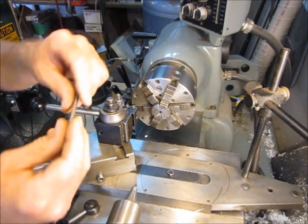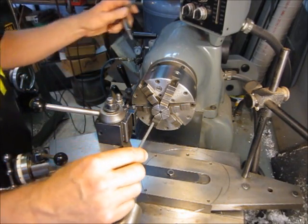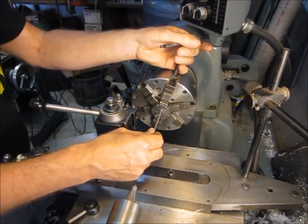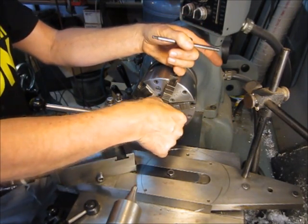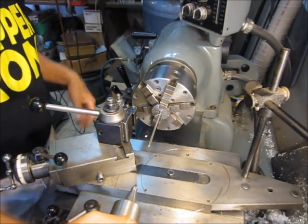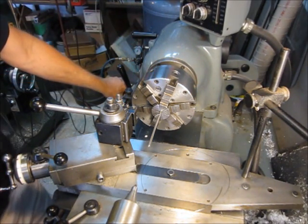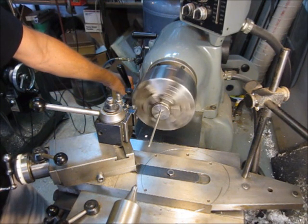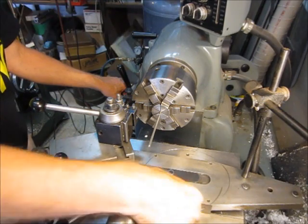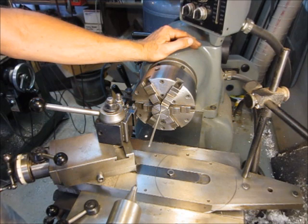So the next thing we're going to do is mount the mandrel in the lathe. You can use a chuck like this or you can use a collet, whatever you like. Leave about a half inch or so out past the cross-drilled hole so you have some room to work. Then set your RPM on the lathe — you want it to be as slow as the lathe will go. In this case, it works out to about 125 RPM. You don't want it cranked up to high RPM because you're working with wire and you don't want things to get out of hand. Set it as slow as it'll go.